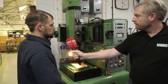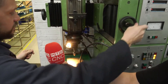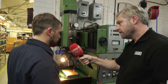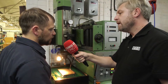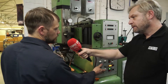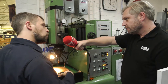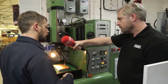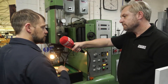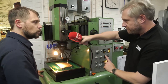Yeah, so you've got your X and your Ys, so you can manually move this around. This would be for more one-offs, repair jobs — if we've had to weld up a mould tool, we can fettle it into the edge. You can actually feel the sparking, so you're in control of it. Exactly. And you can control the powers to get the finish you want, because sometimes the finish is a worn finish because it's been moulded. If I wanted a 24 VDI but it isn't a 24 VDI, it's worn, then I can fettle the controls to match what was originally there.